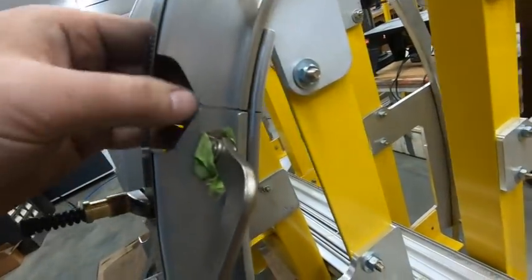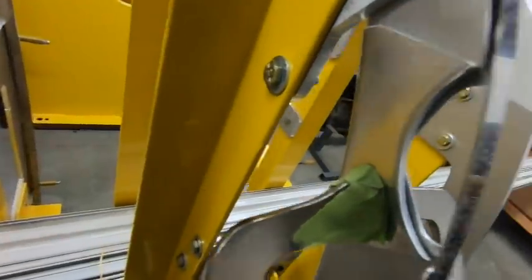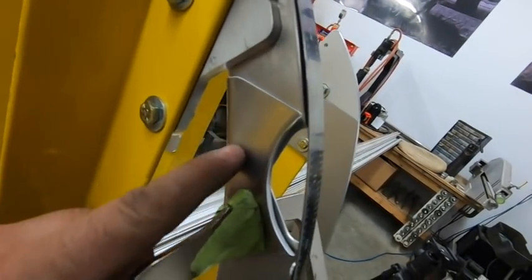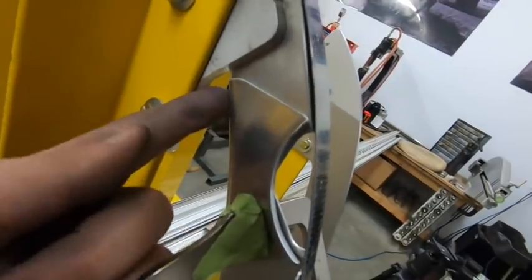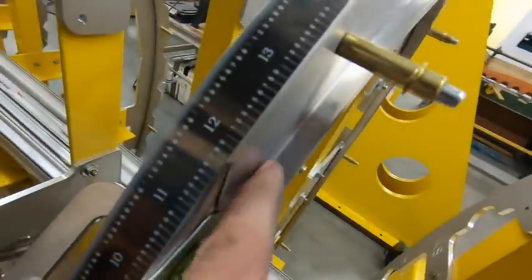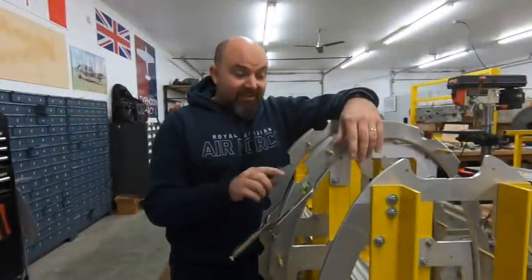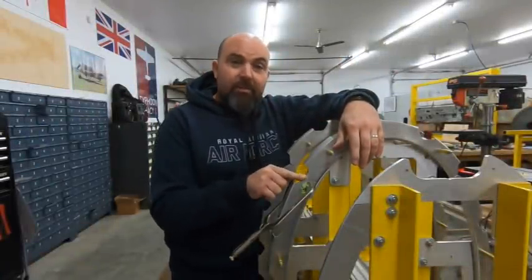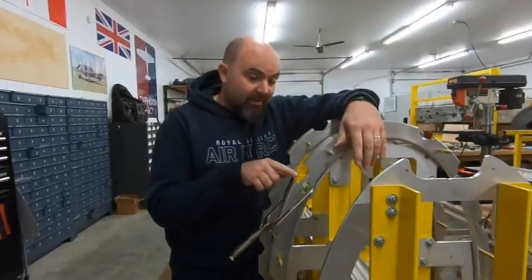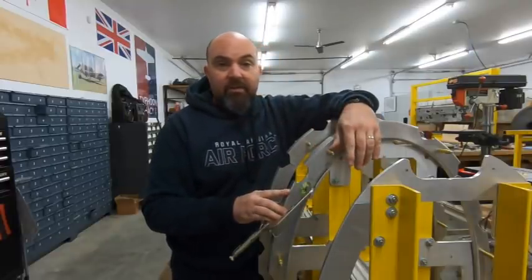Doubler plates are in position. You can see in here it reinforces the area around that stringer cutout. The stringer is going to pass through there. There are five rivets placed in this area on both sides of that splice, and then there are rivets also placed in this channel here, riveting this way. So there you have it — that's the process I deduced to build these little guys. There's barely any material in them — they just use the scraps left over from the production of the frames — but they're very finicky and they've got to fit just right or we're going to end up with a lot of deformation on structural parts, which is not good.